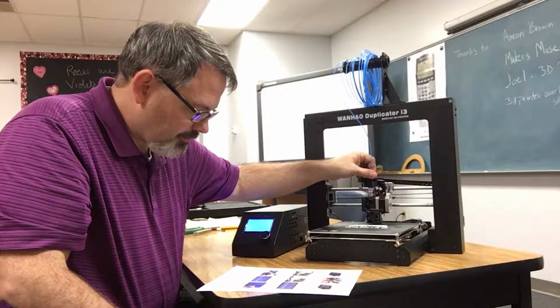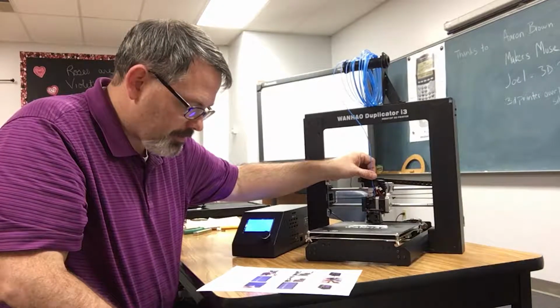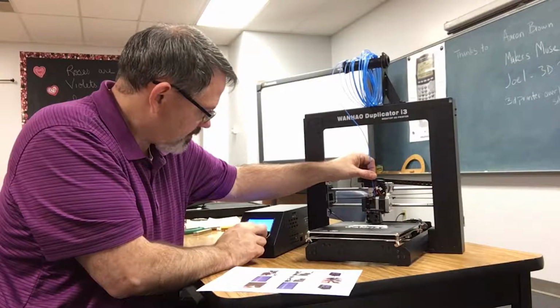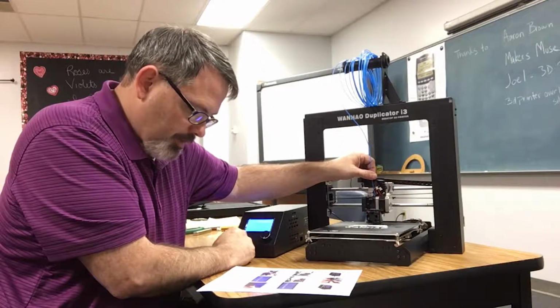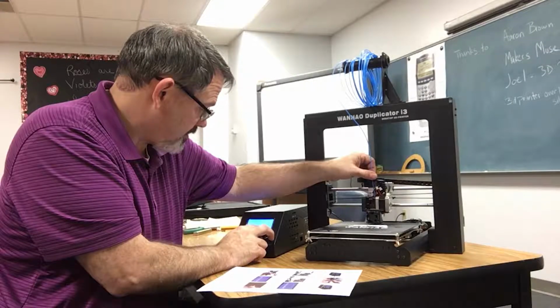Carefully insert the included filament sample into the hole in the extruder as shown. While holding the filament in place with one hand, press the knob on the power supply to activate the menu system. Turn the knob to the extruder entry and press the knob again, and then turn it to extruder position entry.